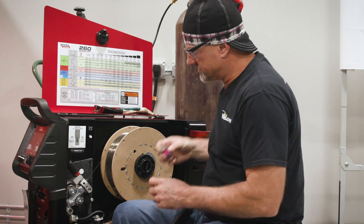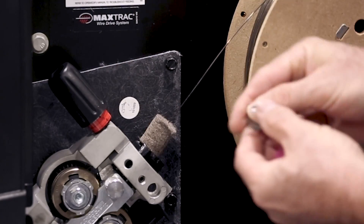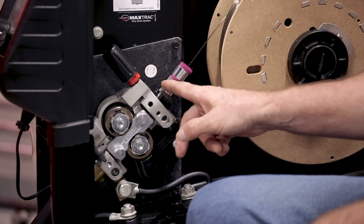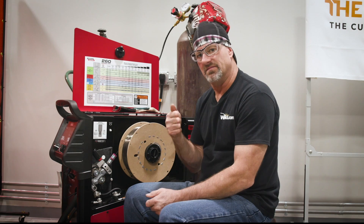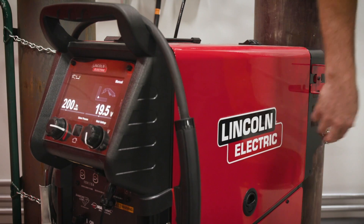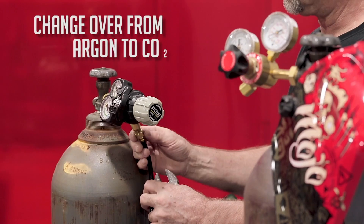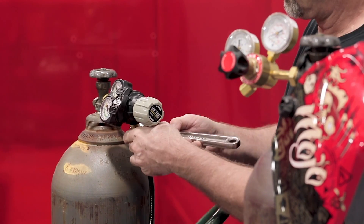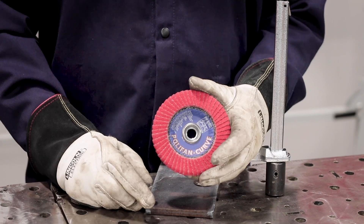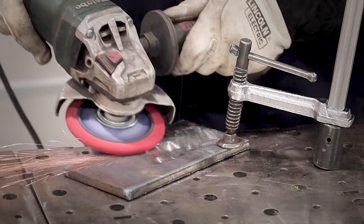What I also like to add is a cleaning brush and a lube brush. I like to put the lube brush on first. I like to use these cleaners and lube so it makes everything roll a lot better. So when you're welding, you don't get intermittent feed — everything runs real smooth, and that's what you want. Today I'm going to clean up these T-joints before I get started. These things work really well, which is why I like using them.